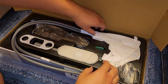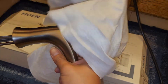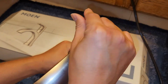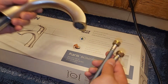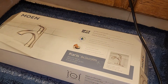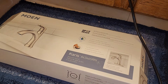Let's go ahead and open the faucet. The hoses or supply tubes are attached directly to the faucet and just wrapped around it — they're not replaceable, so hopefully they're long enough. Here you can see the aerator. I'm going to take the aerator out first so that when I open the valve, it can drain. That's usually what you need to do — drain out any debris.